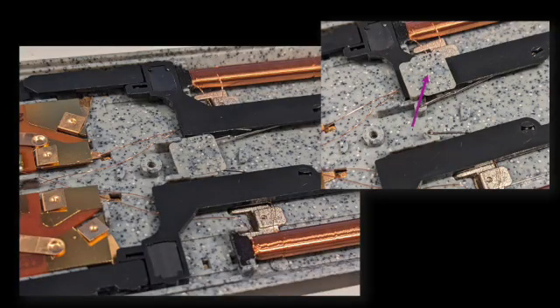Put that plastic piece back in place on the track piece itself, because it holds those two wires in place. When they fall out it's really annoying — they're very small and in a tight spot. I can show you with close-up photos: on the left the piece is in place, and on the right I've shifted it back so you can see the two little wires that stick into those sockets. You'll also notice that plastic piece has two corners cut out, which fit into two raised bars on the left side — so it fits one way and not the other. Keep it in there the whole time you're working, to hold those two wires. I did actually have one of those parts fall out while putting this video together — it's not a big deal, just annoying. So keep an eye on that piece; it's the fiddliest part.